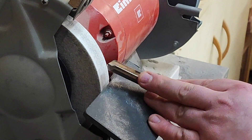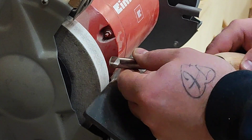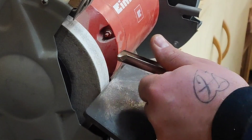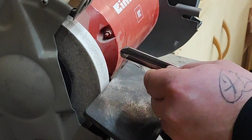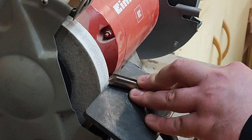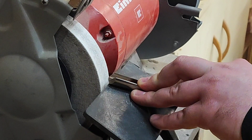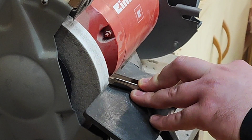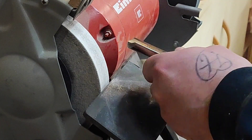Here is that traditional grind. The important thing to know is that this is a V-flute bowl gouge, which means the wings or sides of the flute are flat or straight. I do prefer the elliptical or parabolic flute shape — I mostly use Henry Taylor, Hamlet, or even Crown Tools, which have that parabolic flute shape.